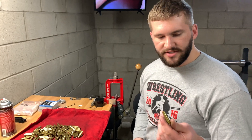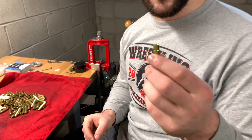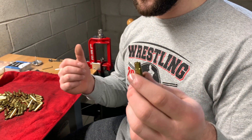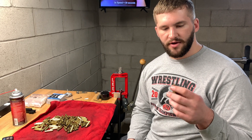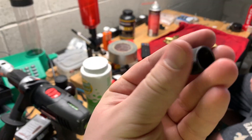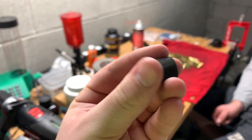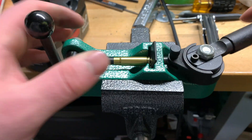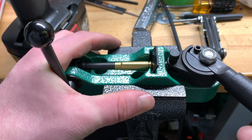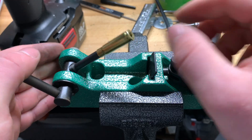We got the brass cut and trimmed. We ran into an issue — what I think is happening is we're getting a little bit of inconsistency from the die because of the different headstamps, and we still had the .223 neck and shoulder on it. So Franklin is over there deburring it from the cutting tool, and then I'm sizing these again, waiting for the battery to charge on the drill so we can cut it and then get down to business. Best use of our time right now.